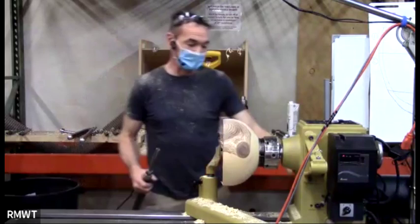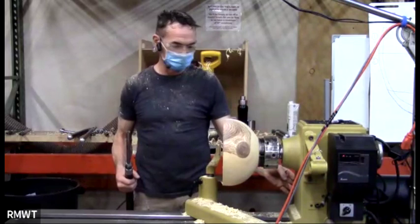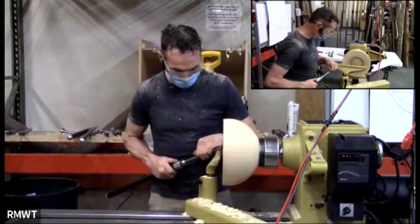Two options. If I'm going to shape the rim and do a fancy shape on the rim, then I have the option of simply cutting in either direction, and I won't get torn grain. If I cut with a curvature going one way and a curvature going the other, then I can use my 40-40 gouge. If I'm leaving it flat, I can take a small cut pushing in.